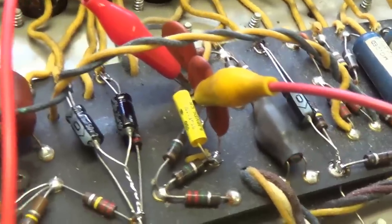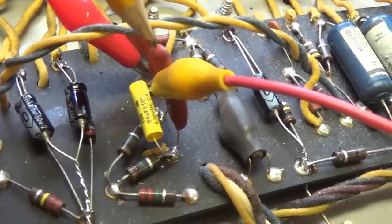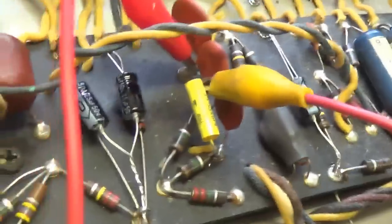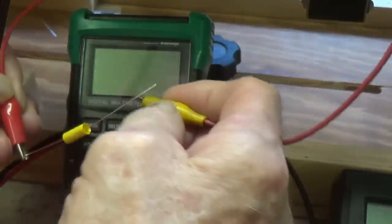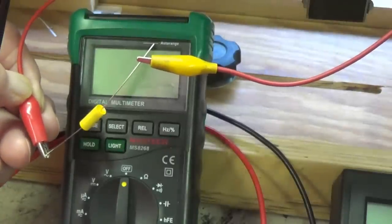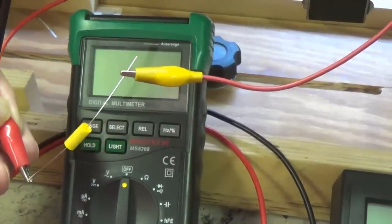You all know what a tremolo hound your old uncle is, and I can't resist. Let's go ahead and add another 0.01 microfarad cap in parallel to the second of the existing 0.01s. Okay, so we'll be doubling up both of the 0.01s, not just one of them. Let's see what it sounds like with and without. Okay, here we go. That's with one parallel 0.01. I like it. Let's go ahead and jumper both then. Okay, let's hardwire the second one in. Okay, two supplementary capacitors. Are you ready?